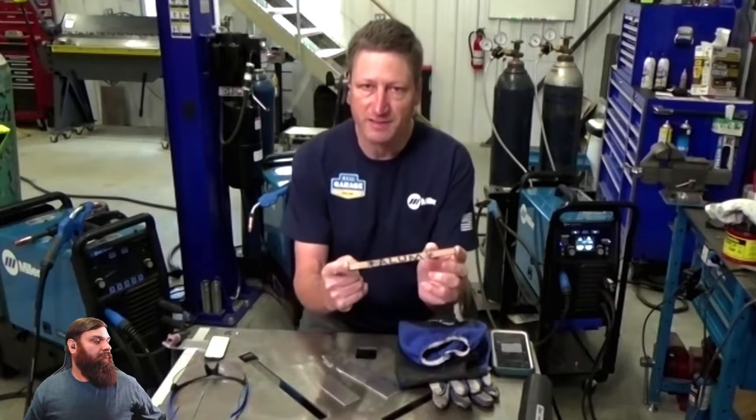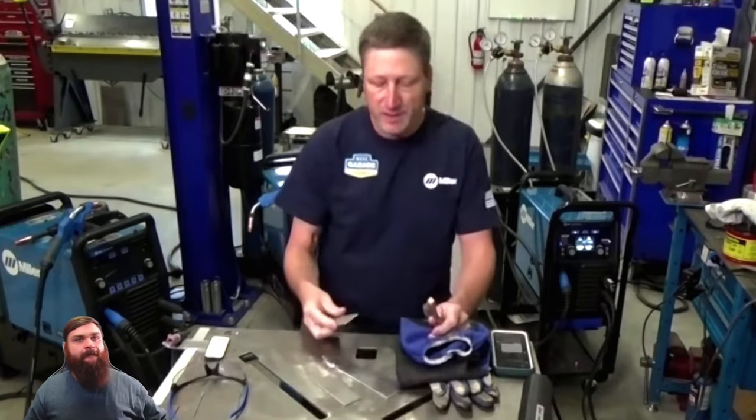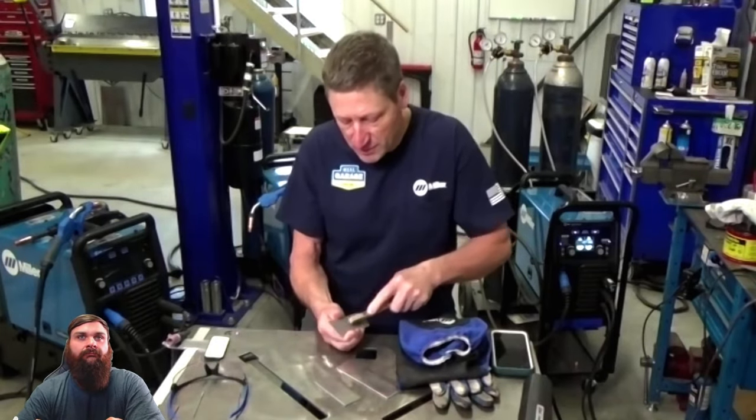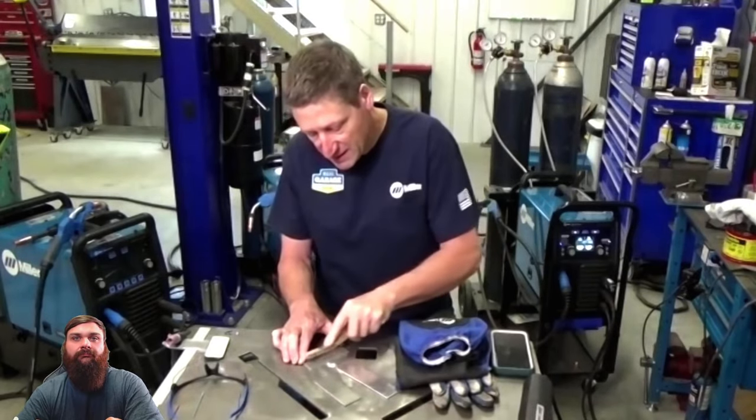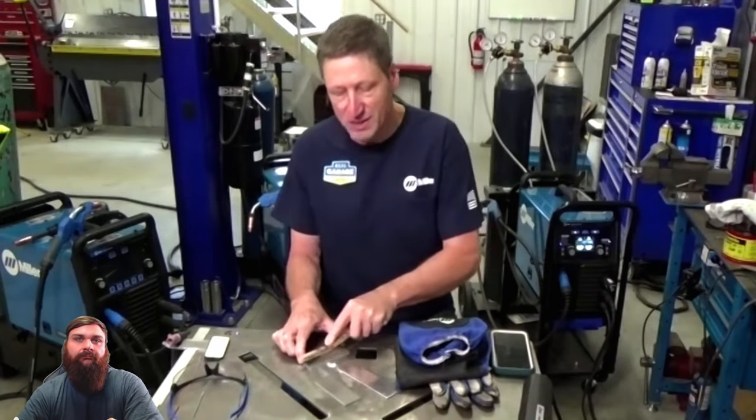For best practices, always try to remove some of that oxide mechanically first. Use a dedicated brush that's just for aluminum — a stainless steel brush. The oxide layer is so hard that if it's a critical component, you don't want to just rely on the welding machine's ability to chip that oxide off. While you're brushing, you'll find the aluminum is actually quite hard — almost like brushing a piece of glass, the wire brush slides across it real easy. But as you start removing that oxide layer, you'll see the resistance on the brush go way up, and that's your indication that you've got the oxide layer off because the softer aluminum underneath is starting to grab the bristles.